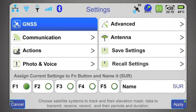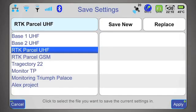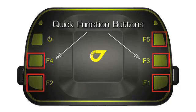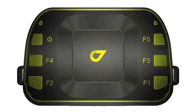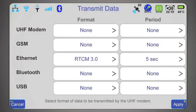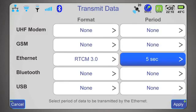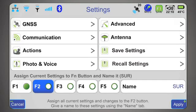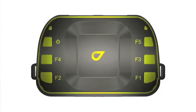After programming the Triumph VS for my particular application, I can store the settings in a file and later reload them when needed. I can record an unlimited number of settings files and assign five of them to the five function buttons on top of the Triumph VS. I save my settings to a file and assign it to function button F1. As another example, I program the receiver to act as a base station and transmit RTCM messages every second via Ethernet, program the Ethernet parameters, antenna, and photo and voice settings, then store these settings in another file and assign them to the F2 function button.